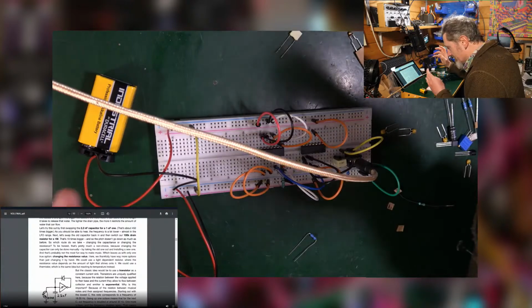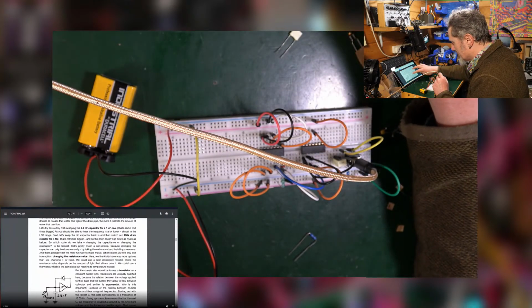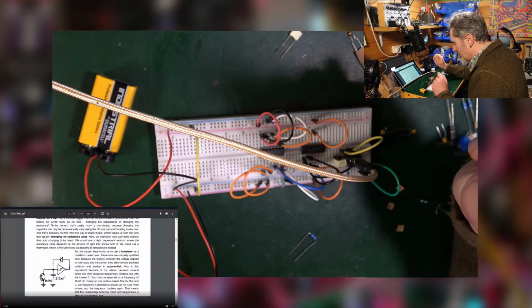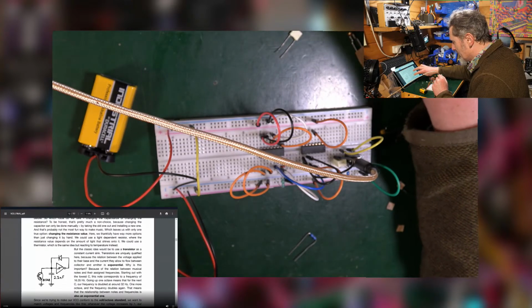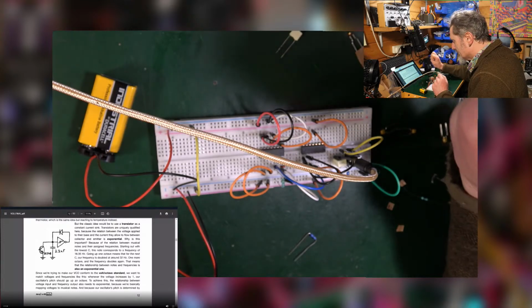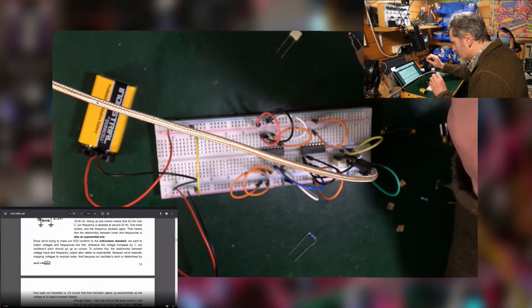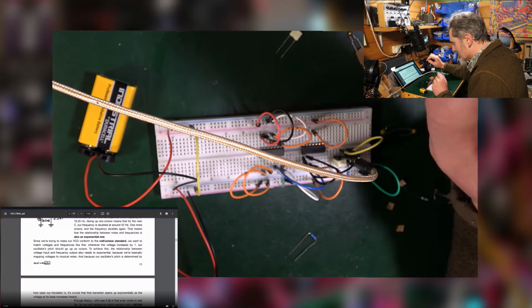And that's important because musical notes and their assigned frequencies are exponential. Because you have frequency doubling, it doesn't go up by the same amount, it doubles every time for every octave. So since we're trying to make our VCO conform to a 1 volt per octave standard, we want to match voltages and frequencies like this. Whenever the voltage increases by 1, our oscillator's pitch should go up an octave. The relationship between voltage input and frequency output needs to be exponential to achieve this, because we're basically mapping voltages to musical notes. Because our oscillator's pitch is determined by our transistor, it's crucial that the transistor opens up exponentially as the voltage at its base increases linearly.